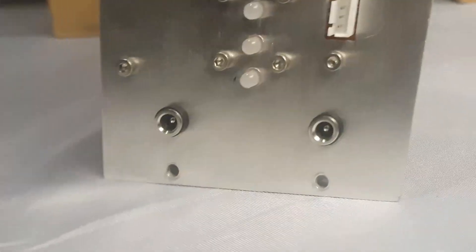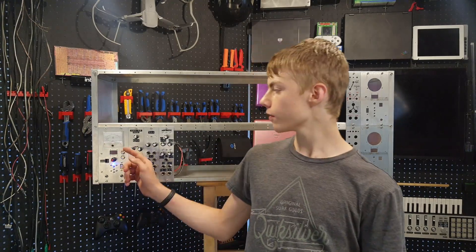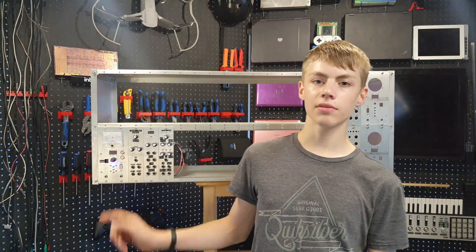This thing's got three power connectors — two on the front and one on the back. You can plug power into any of them and use the available ones as outputs, in case you want to plug in another synthesizer or really anything you want off the same AC adapter. There are also two power buttons: one for turning it on and one for turning it off. That's because I needed the Arduino to be what actually shuts down the supply, since it has an hour counter and settings it needs to save into the EEPROM before it shuts down.